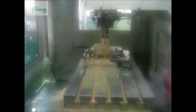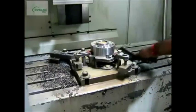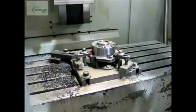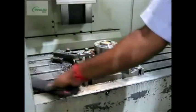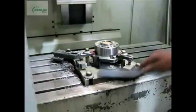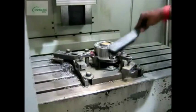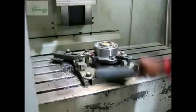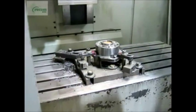The CNC machines which are used for cutting, drilling or any other operations often need to be cleaned in order to prevent tool wear and downtime. Generally, the operator cleans the CNC machine after the production of each worked part. Brushes and dustpans are used to clean the machines manually. This method leads to inefficient cleaning, which would reduce the performance of the machine as the chips get deposited in the gaps or corners of the machine.